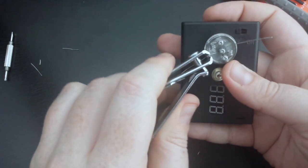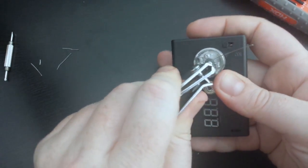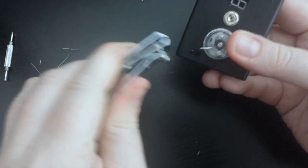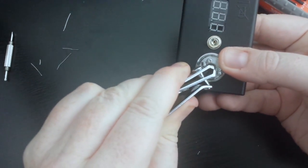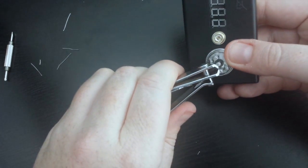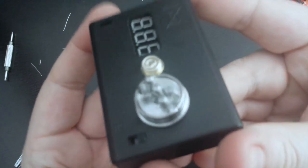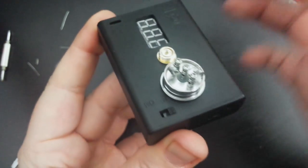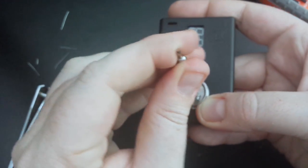Alright, let's go ahead. Do the middle one. Try to get in there as close as you can. You don't want extra wire sticking up like crazy. You want to get in there as close as humanly possible and trim off those leads, and then the rest of the leads that are poking up, you can see those, you want to bend them so that they're going up. Quintuple check, what's the word? For loose screws, we found one.